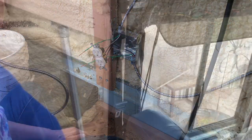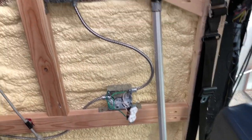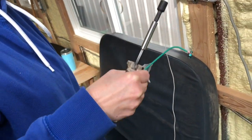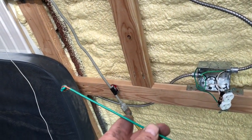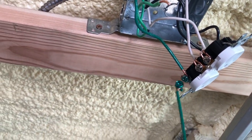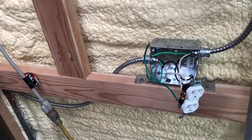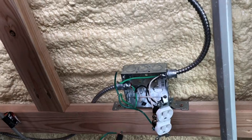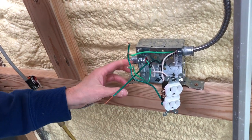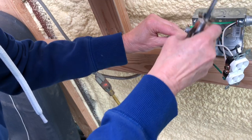Shelly's been a real trooper putting all these outlets in. Something was funny when we got those wires — you buy these wires for the ground hookup. We are not professional electricians. We were taking the screw off and hooking them onto the ground wire, when what we were supposed to be doing is grounding the box and then hooking all three of them together. So now Shelly's going back, opening them back up, and now we've got it — the box is grounded. Snug it down tight!